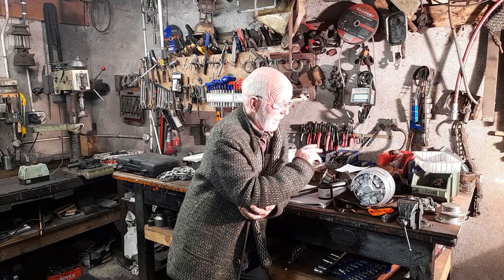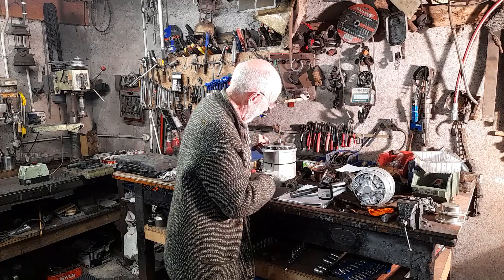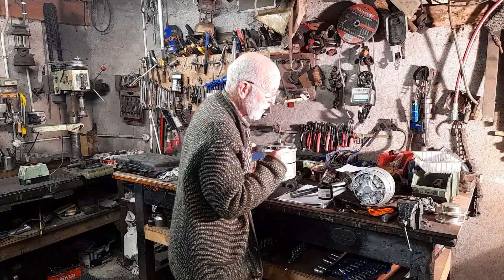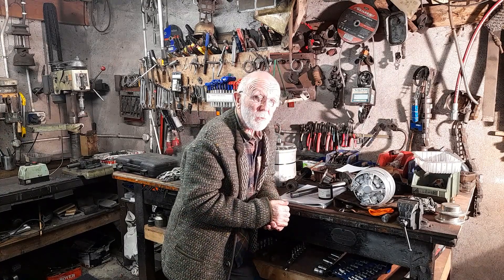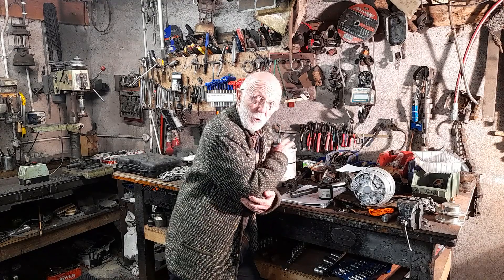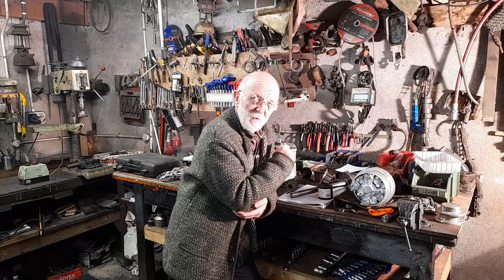It's a lot bigger — 90 amps, that's all you're going to get. The alternator we have in mind as a replacement is this one. Readily available, they're normally swing mounted rather than cradle mounted. We've measured the diameter of the ASE5 and the diameter of this, and they're really pretty close. We have customers out there who are using these alternators on Gardner engines and they're working fine — no problem at all. They don't fry the batteries, they're not knocking out any electronics. Really super job.